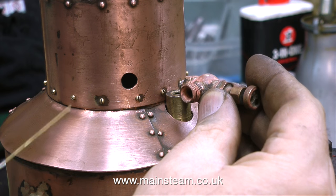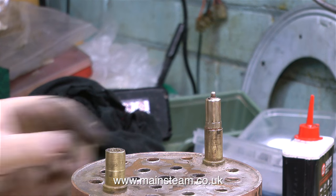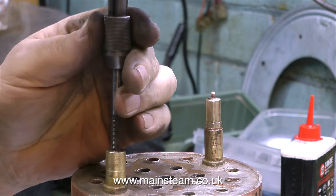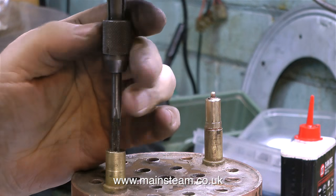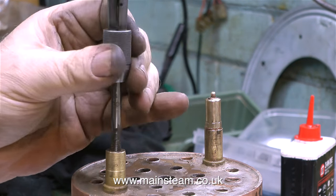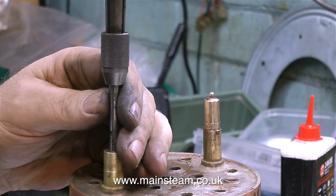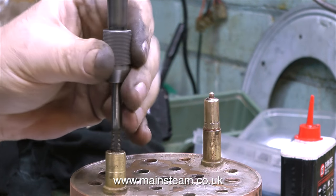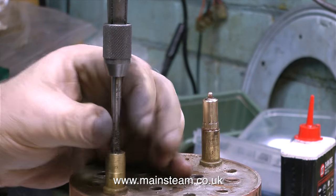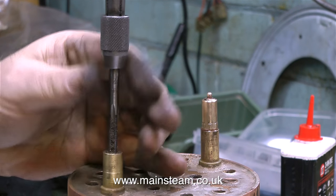I'm going to need to drill another hole to let the exhaust up the chimney. The original wet steam pipe went into the centre of the boiler and down a flue — a superheater flue — but it's very small. Then the pipe continued through the methylated spirit burner flame and up to the engine. I'm going to do it a slightly different way. In order for a steam pipe to pass sufficient volume of steam relative to the size of the engine cylinders, it's important that the steam pipe and fittings have a good internal diameter. The diameter and thread of the safety valve is 5/16 of an inch by 26 threads per inch, but the diameter of the main steam outlet is only 1/4 of an inch by 32 threads per inch, and for two reasons this is not good. The first reason is that the internal hole in the bottom of the steam tap is going to be far too small to pass any significant volume of steam.